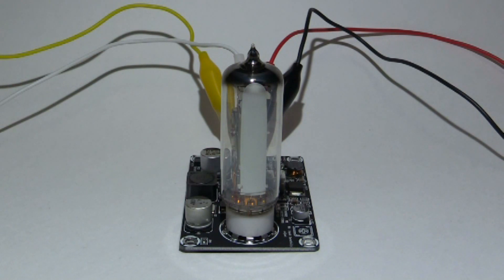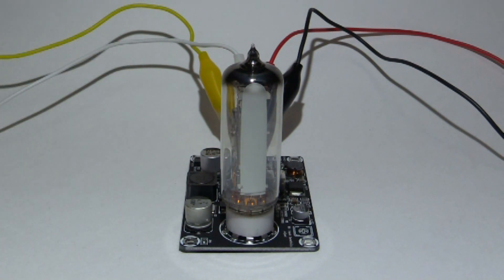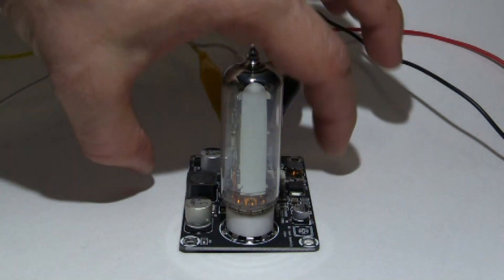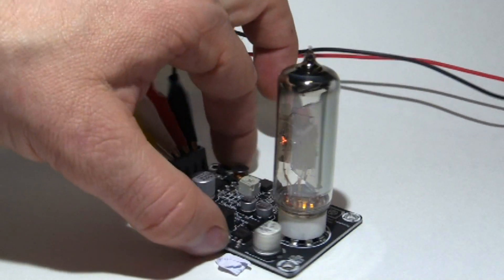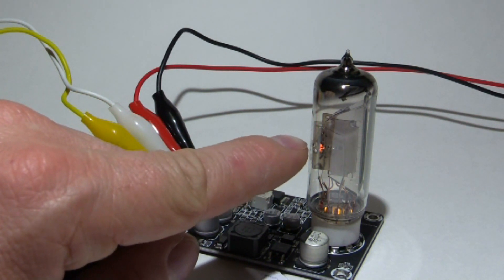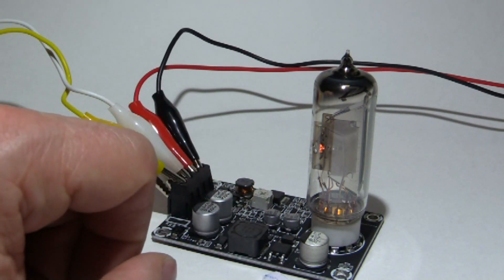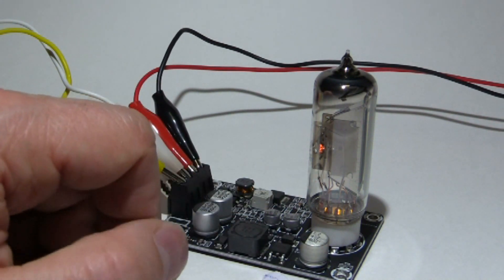At least it's not blue, I guess. I might pull it out, I might leave it. The blue glow from the LEDs you see on these valve amps — it really makes me laugh. Because if you have a valve that's glowing blue like that, it means it's gone gassy and it's going to fail. So putting blue LEDs underneath might look good to the untrained eye, but usually blue glow is bad. If I turn around carefully you can just see the filament glowing — that's a true glow, it's not an LED or anything. So that's as much as this one makes.